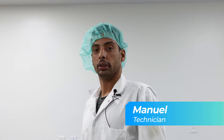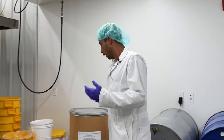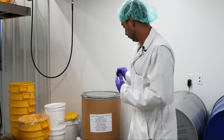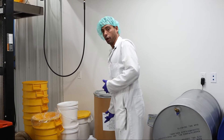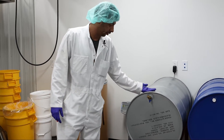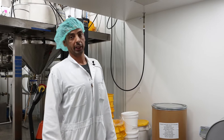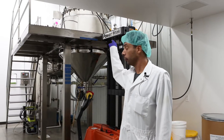Hi, good morning. My name is Emmanuel Barros, I'm a softgel technician here at Softgel. I'm going to go through a little bit of what we do to make the gel. According to our mixture, we'll add distilled water per part — it will be mixed with the glycerin. We have 55-gallon tanks of glycerin. After we get our water and glycerin mix, we'll take them up to our 300-gallon mixer.